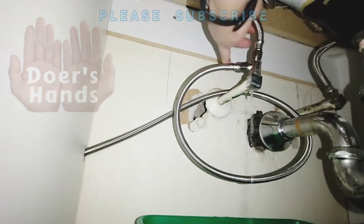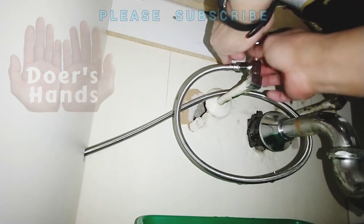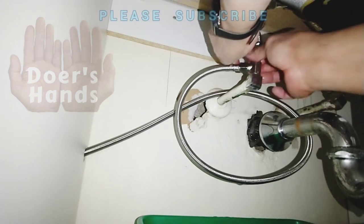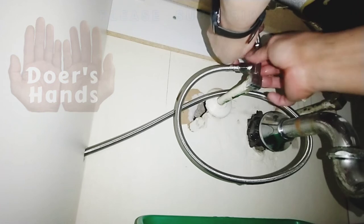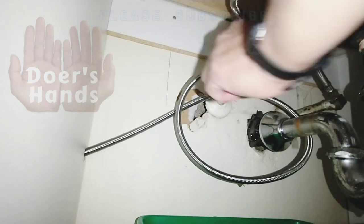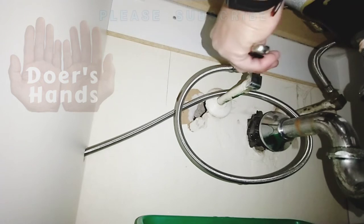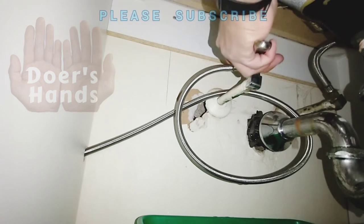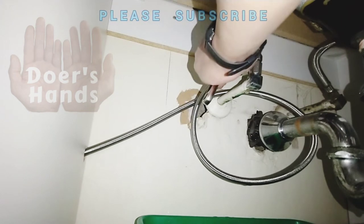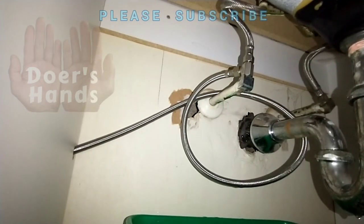And then this is the final fitting. It goes to the lavatory faucet. Make sure you're all lined up so you won't ruin the thread. It's turning easily. Snug. And double check if there's a leak. There, it's all done. Now we will have to make sure it's not leaking.